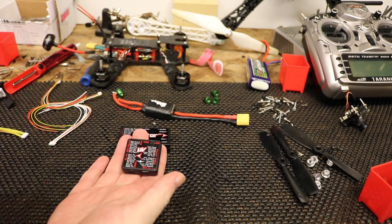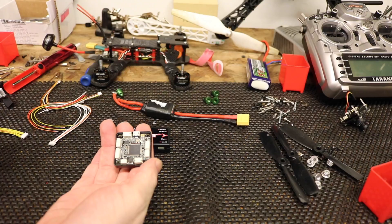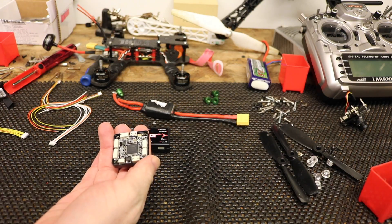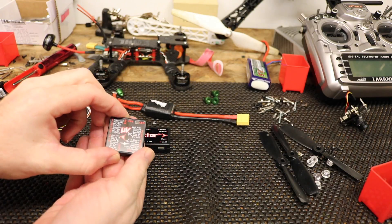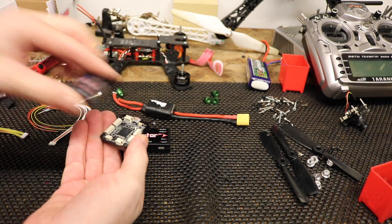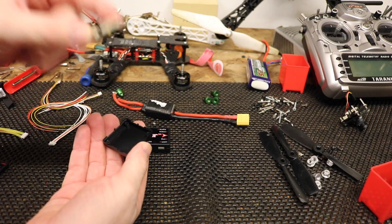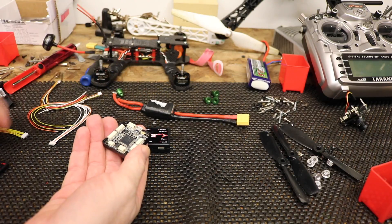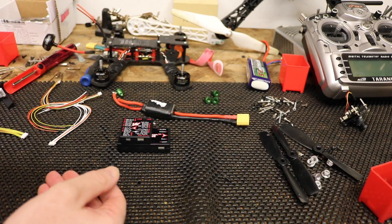In fact, it's actually stackable — the usual four-post stackable size that fits any normal quad. It comes in a plastic hard case like that for mounting in that way. But if you remove the four screws on the back you can pop the flight controller out and directly mount it in a post configuration just as you would any of the other usual race flight controllers.